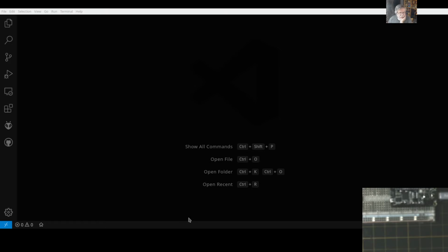There we go. RP, we boot, we go to here, the macro, backup one, and we go and find Arduino, Pico, Adafruit. No, where is it? Adafruit RP2040 Feather, right there. Do we have a 7.0 in here? Yes, we do. Copy. And we reprogram this. Paste one file. Ta-da! And it should restart.